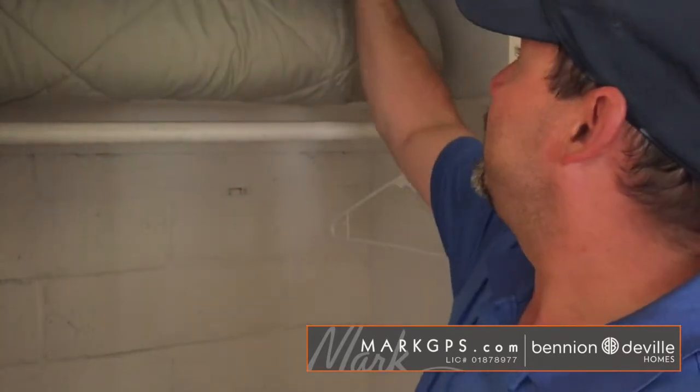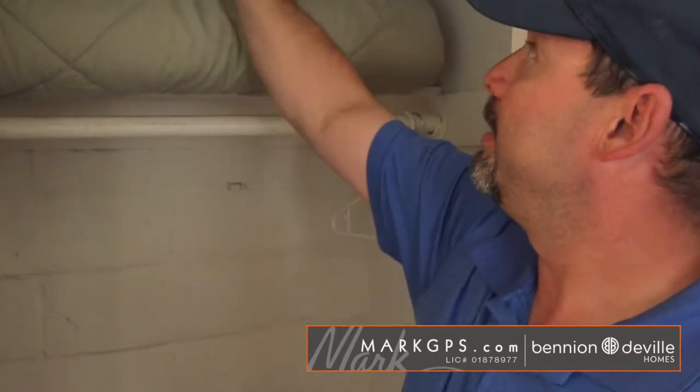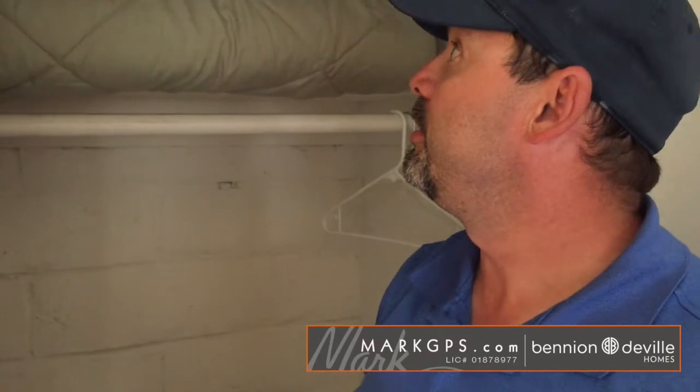It's a rolled composition roof. There's no patch marks. There's no evidence of any leaking right now up there. But it could have leaked, and that's what this is. And it looks like they tried to seal it a little bit with some caulking on this end and tried to cover some of that moisture stains. Okay. But I think it's because there was a roof valley right above this area. Okay. Great. And we'll go into the bathroom.